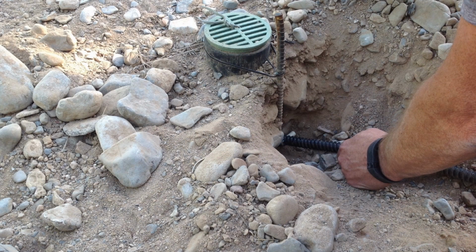And here's our gypsum block, buried about 12 inches next to our sample bottle. When significant flow occurs in the wash, we should witness infiltration down to the block, causing it to get wet and change its resistance. The resulting signals are then transmitted to ThingSpeak, which can be monitored via an internet browser.